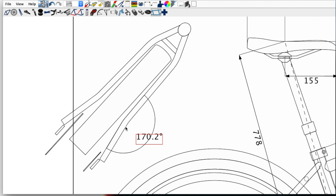There's spring back with the tubes and you don't always know exactly how much spring back you're going to have — it's a little bit of a guess until you get to know the particular tubing. How much spring back you can expect depends on the particular tubing, bend angle, and so on. I was going for 10 degrees and I bent it to about 14. I haven't measured it yet but you can measure it pretty easily. If you didn't bend enough degrees, you could put them back in the bender and re-bend. Over time you'd learn how much spring back to account for. This stuff came out the first time every time.